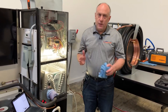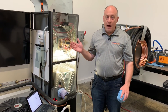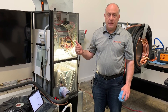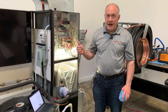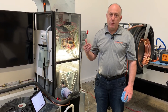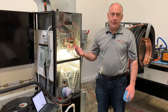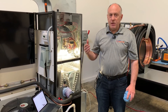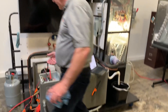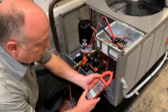You can't do this with a normal amp meter because it simply doesn't make all the measurements you need. You actually need true power in watts or kilowatts — and that's what the Redfish meter does. It measures power, volts, amps, and power factor, so we get a true reading of system efficiency. We can show that to our customer, make a great impression, and assure them they're getting the efficiency they're paying for. That's why you want to invest in a meter like this.